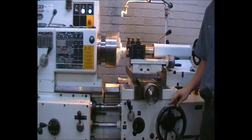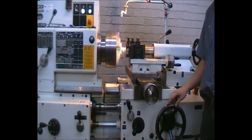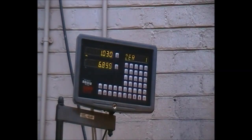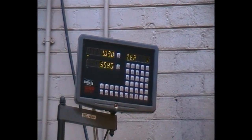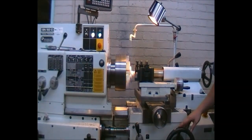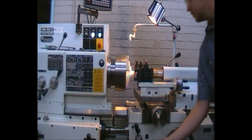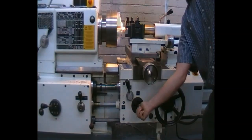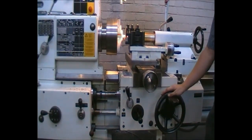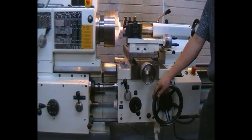Thus, the stock material is not a good reference point for anything to work from. As we get closer to the chuck, we will see the shaving might start to pile off — please do not be afraid as you have the necessary PPE. We will now disengage the automatic feed. If necessary, we would feed the last 2 or 3 millimeters by hand as constantly as possible.